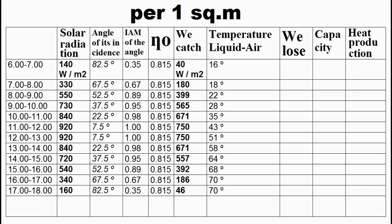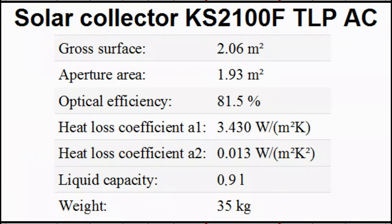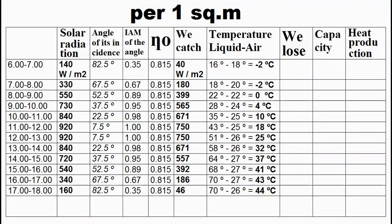Here we write the average temperature of the fluid inside the collector, and now it is the temperatures for the task of heating water of a tank from 15 degrees Celsius in the morning to 70 degrees Celsius in the evening. But these temperatures will be different if our collector is used for another task, for example, these are temperatures for the task of heating pool water. This is the ambient temperature, and we can notice that this is an example of a sunny day in central Europe in August. Here we write the multiplication of this column by this coefficient of our collector, and thus this column describes the losses of useful heat from our collector.